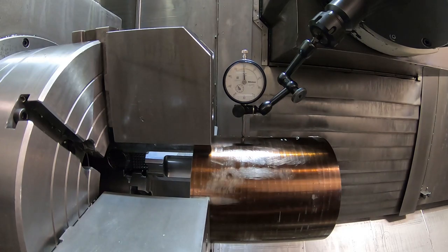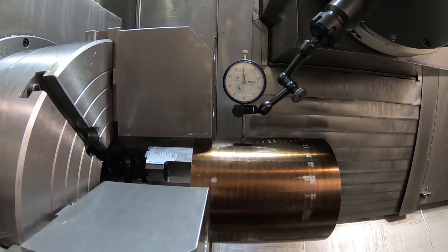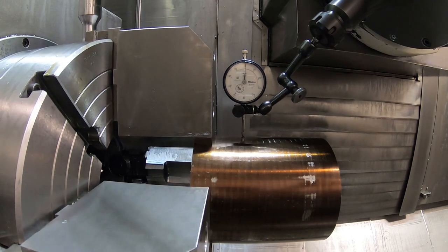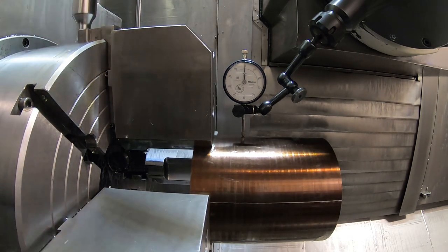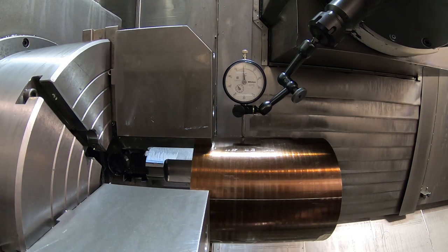on the other side. Right now that I got a little bit more tension on the jaws, I'm going to make sure the stock is up against the shoulder of the jaws. That's pretty close to zero that way, so we'll do these other two now, which are very close, it looks like. Tighten the bottom one, then tighten this top one. We'll bring it back to zero. Tighten this one a little bit more. Then tighten the bottom one and bring it back to zero again.